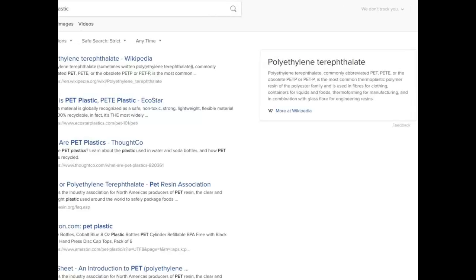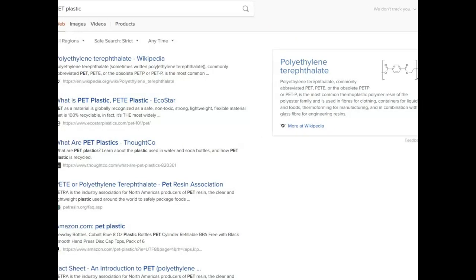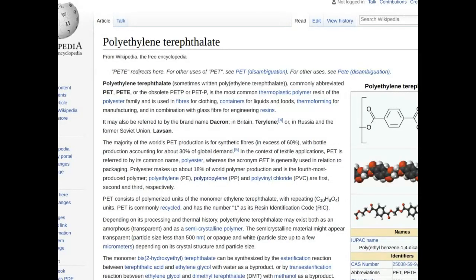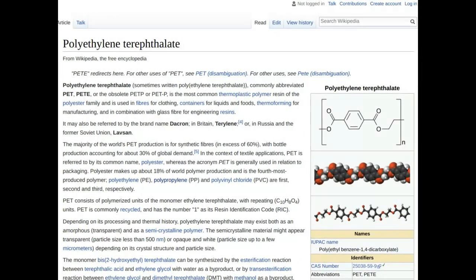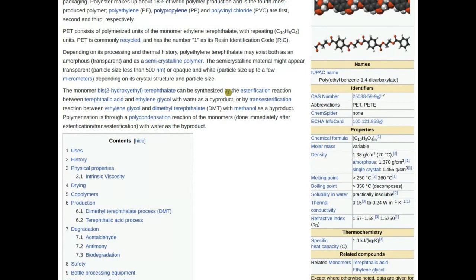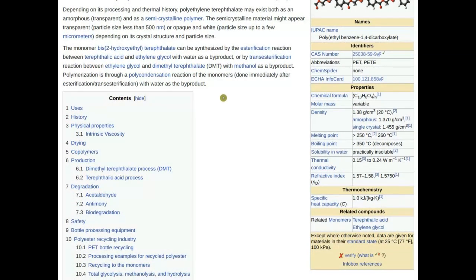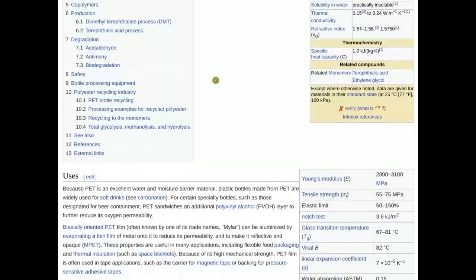One of the challenges with PET is that it also crystallizes. In its crystalline state, it's brittle like glass — you could crack and snap it and cut yourself on it. So it's a pretty interesting plastic. I remember something like ABS is about 8,000 PSI for its compressive strength — do you know the values for PET?